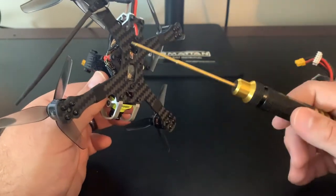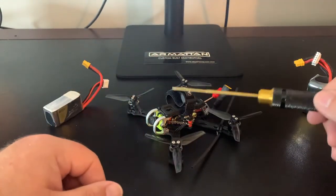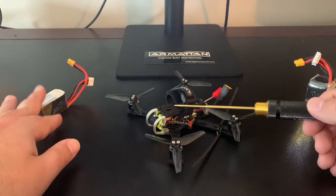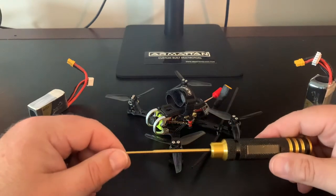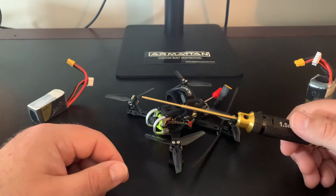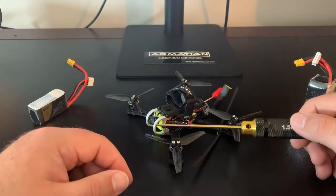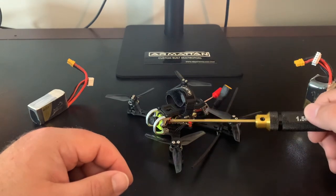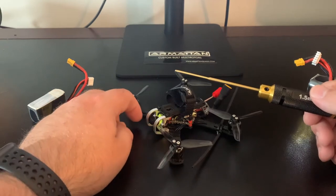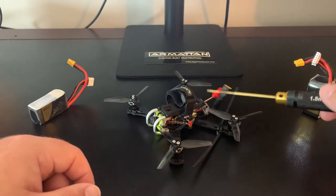And with the traditional linear antenna for the Crossfire, I got much better range. This one never fell below 99 link quality. And I was only running it on 25 milliwatt dynamic power. That's generally what I fly. Initially, I only flew at 10 milliwatt, but I did bump it up to 25. Even at 25 in my area, where I'm not in town where there's a lot of Wi-Fi going on, it will still outfly the video on 200 milliwatt.